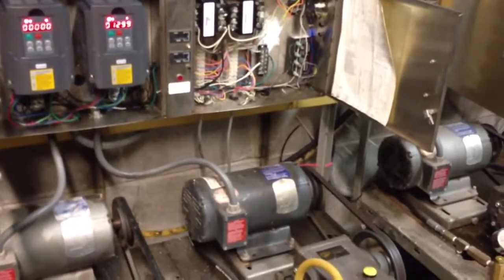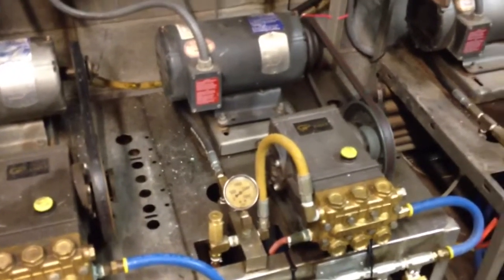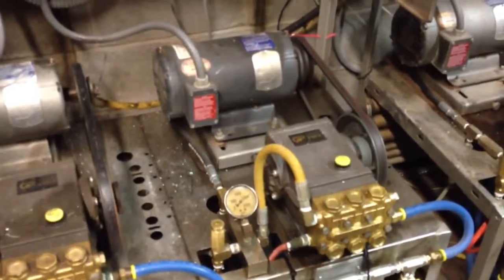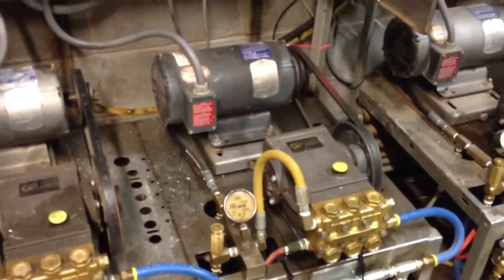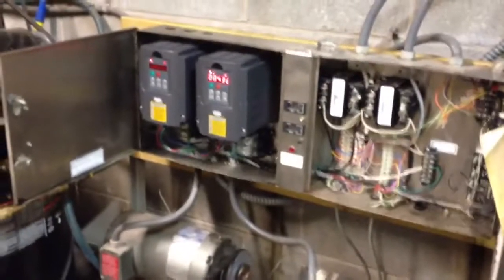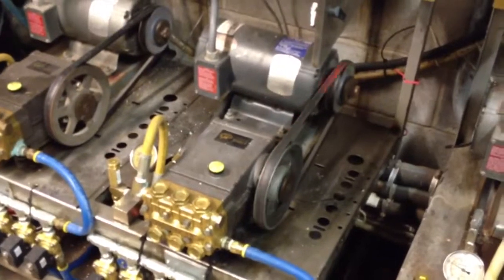Slow ramp up to 1300 RPMs. At 1300 RPMs we're still maintaining full flow — I do have the gun with a zip tie on it outside and that's full flow. Now that it's purged the line, it's dropped down. That gauge reads about 200 PSI for low pressure mode, and you can see we're running 430 RPMs — it's so slow you can watch the belt move.